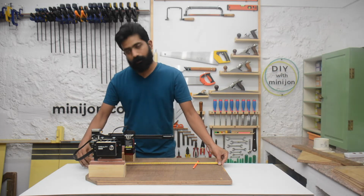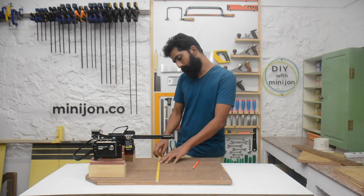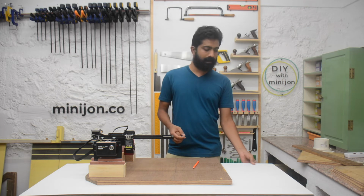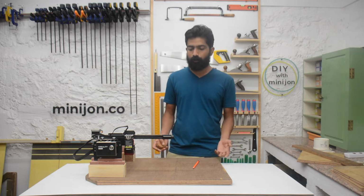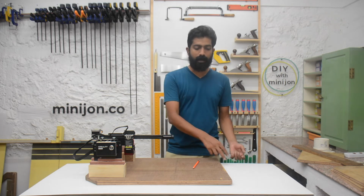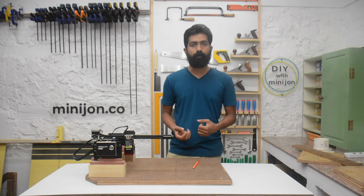It's about 26 inches in this direction and about 19 inches in this. So I'm going to use this 10mm laminated board. It's good to use a laminated board for the insides of the box, because the white laminate will increase the light and also it will not absorb the fumes.